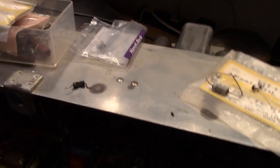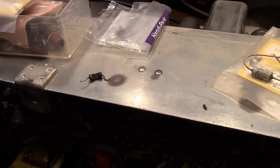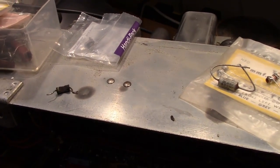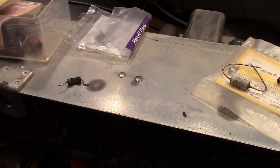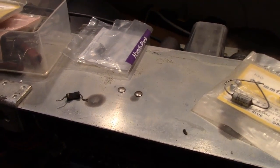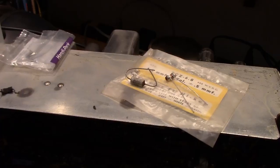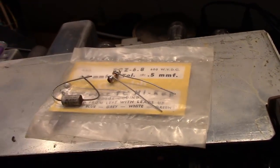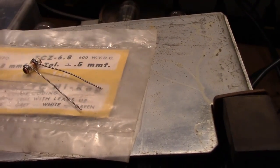And they're cheap enough. I found some at Mouser that are like 10 cents each, so I figure I'll order up 10 or so, because I'm going to have some failures, because I'm going to have to attach some itty-bitty wires to it. And I imagine the package, I think it's a 1206, which, as memory serves, is pretty darn small, so it could require some effort. Or, hey, maybe I can find some in my stash, and I do have some of the type you'd use in tuners, these ceramic guys. Just don't have any small enough, though.